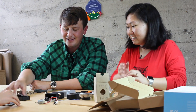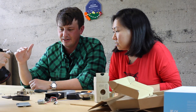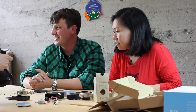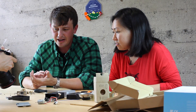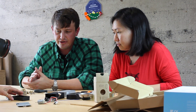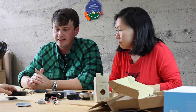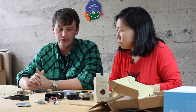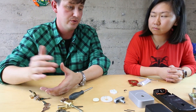Save money - exactly. We have a window here where you can send your blink-up code through, which is kind of like the classic Electric Imp feature. Everything else is pretty basic - it's basically just a Wi-Fi to BLE bridge with a few status codes. Compared to our second generation where we had Wi-Fi built in, with this the bridge just plugs into the wall. You get low latency and can control it everywhere. With version 2 you'd have to tap unlock and then it would go into sleep mode - if it wasn't awake you'd have to wait five minutes for the command. With the bridge it goes through in less than four seconds, and if it's warmed up, under a second.